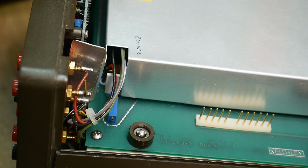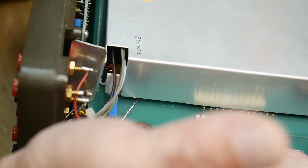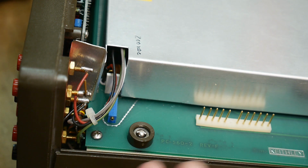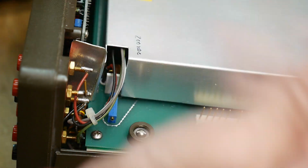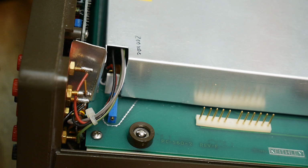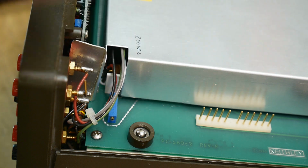And I think I had to push the resistor pack over a little bit. It had been bent this way, and I bent it back. So maybe somebody opened it up once and put it on wrong, and that shorted it out, and that's why it didn't work. And that shorted it to ground and blew up the micro. Who knows, right? You don't know what the vintage is of these things. So anyway, looks much, much better. And yeah, we'll leave it there and put it on the shelf.